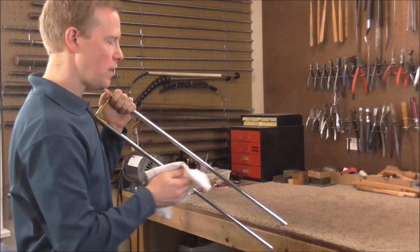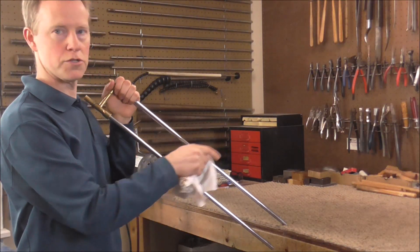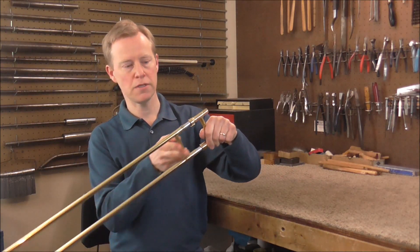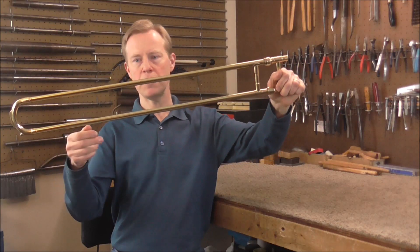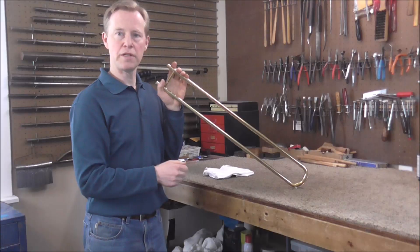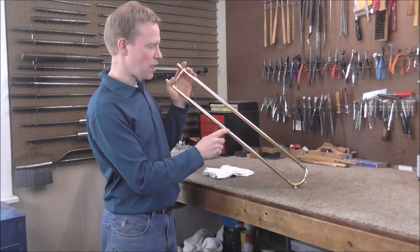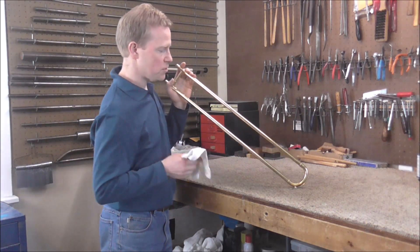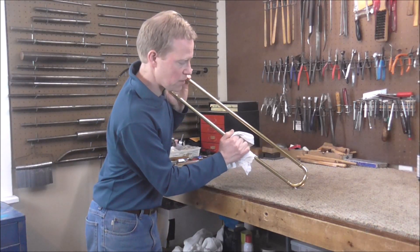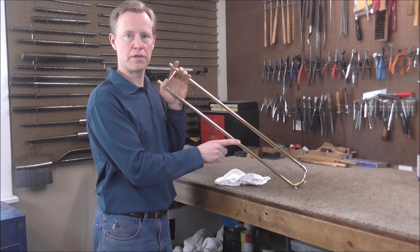The inner tubes are done the same way, but they are a lot more flexible, so you will have a lot more bend on the inner side tubes before they straighten out. After working on the slide for a few minutes it is a lot better than it was, but still not good — a slide should slide out at about a 15 or 20 degree angle and this one does not do that. If the bend is a sharper bend over a smaller area, you would not straighten the entire side tube; you would just work the specific area, pulling down or going back and forth over that one small area where the bend is.